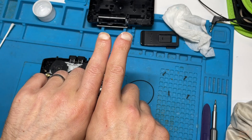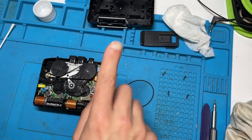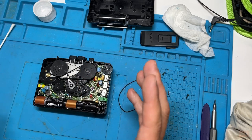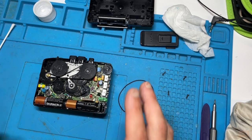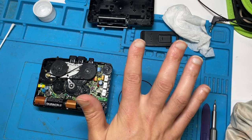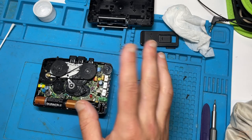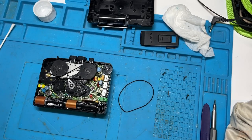If it's kind of moving up and down around the frequency, that says there's going to be a little bit of wow and flutter. So rather than just holding a note like dee, it would be like dee, dee. It just gives you an indication. So there's a little bit on there, but when you listen to it on a device like this through some speakers or headphones, it's just par for the course, and it shouldn't be too noticeable, and the speed is all good now.